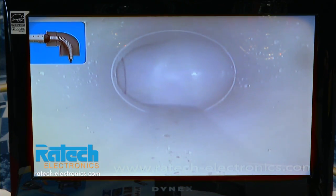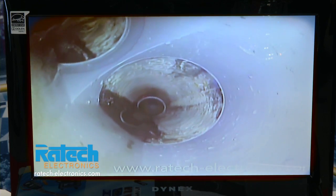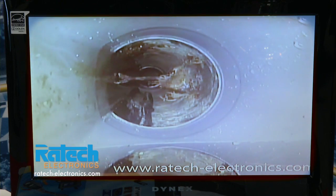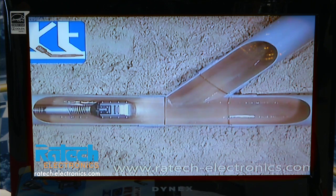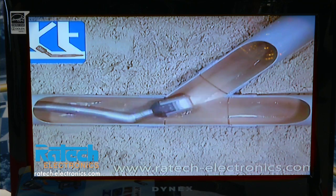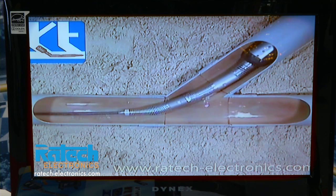You can actually do 90 degree bends in the pipe for a 4 inch pipe. Probably the most important feature of the camera is that it is steerable. It comes with an optional steerable gooseneck, so you're able to do your left and right Y connection pipes. Here you see a pipe inspection where there's a Y connection. You'll notice that the pan and tilt push camera is setting up to go up the left side of the Y connection to do a lateral. So you rotate the camera to the left, and once it's into the Y connection, you straighten out the camera and can conveniently go up the lateral pipe.